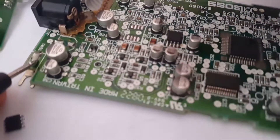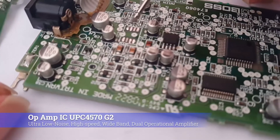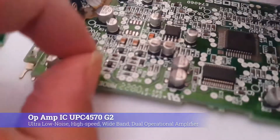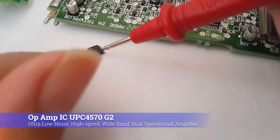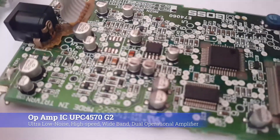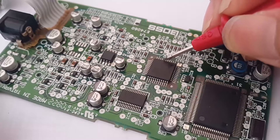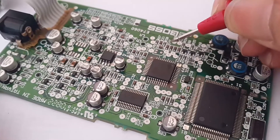So I'm going to try to replace this op-amp IC — operational amplifier IC — which I've already pulled out from the board. I'm also going to check the SMD capacitors and replace these. They are connected to the sound controllers.